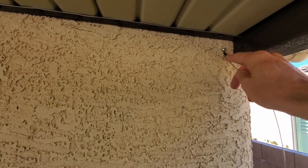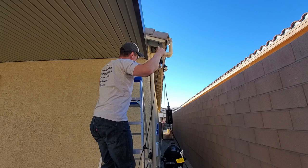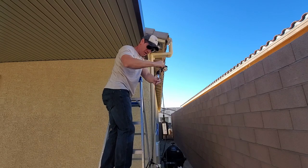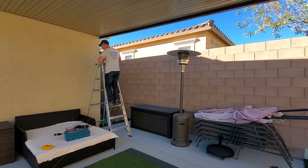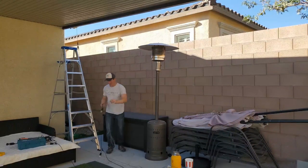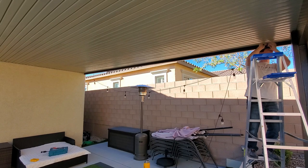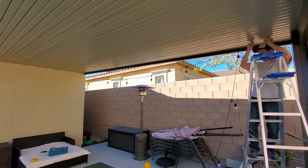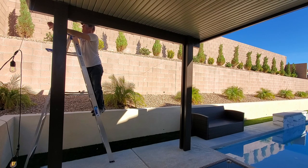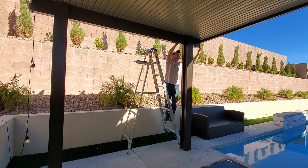And then we have 2 options. First option, we can hang the string lights on the guide wires with hooks. And second option, we can run the guide wire through each hole at the top of each light. And we chose option number 2. We felt that it would look better and be more secure in the wind. So at this point, we simply ran the guide wire through each hole at the top of each light. And we did this all the way till the end of the patio, for a total of 7 lights. Then we wrapped the guide wire around the back side of the patio at the top. And it came around to the other side, and from there we'll run it back the other way and secure it to the wall, with a turnbuckle to a bolt.